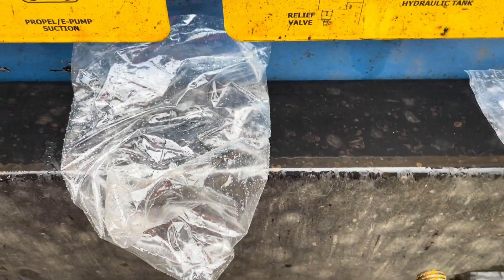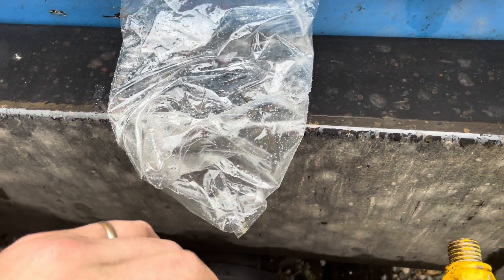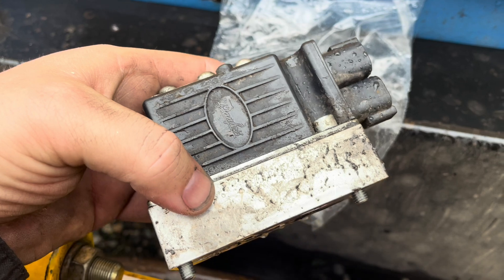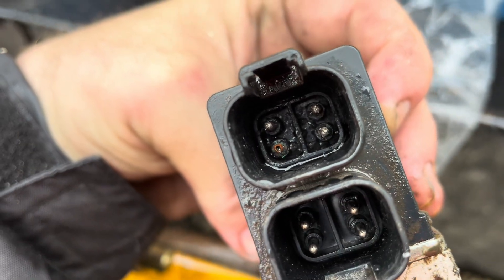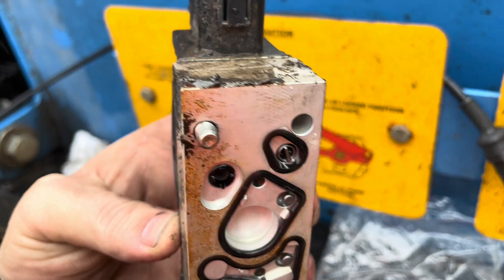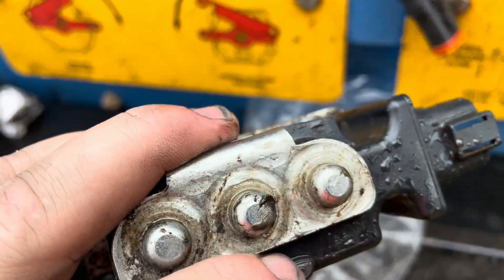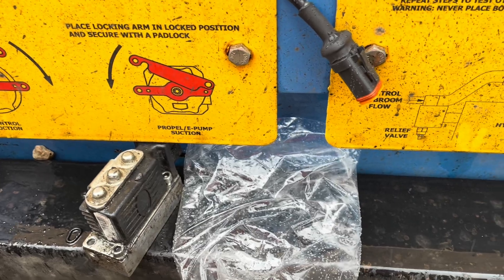Next day. We're working on the last one now. These are what the coils look like on these — one of the seals is laying right here because it's stuck to the valve bank itself. These are our Danfoss coils. You've got your two connectors — you can see where that one has the rusted pin, that's what's messed up on this one. This is what the inside of them looks like — four bolts hold them in, and there's a little green LED that lights up whenever it's energized. Once we get that hooked up, we'll get all these wires plugged back in like it's supposed to be and test it out.